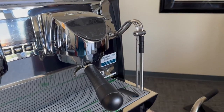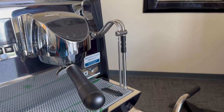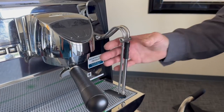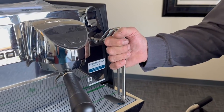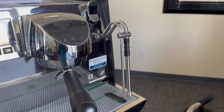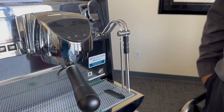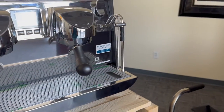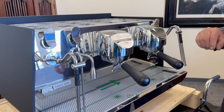If you're comparative shopping for a frothing wand, generally the best systems work off of a pump instead of a venturi — although Rancilio has done a good job with theirs, which is typically a venturi. The venturi slows it down a lot. That's the main disadvantage — you have to slow down the steaming process to get the air injection.